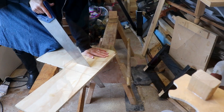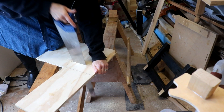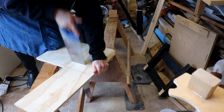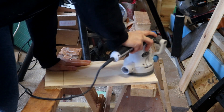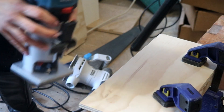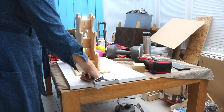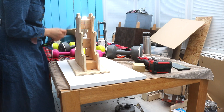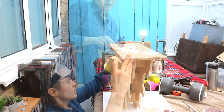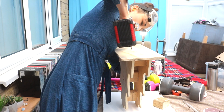I don't think the base was really necessary, but I can be clumsy and my dog can certainly be lively. So I hand sawed another offcut, giving it a nice lip, sanded it and rounded the edges off again. Finally, I lined the base up evenly, checking all around with a combination square, made some quick pencil references, then glued it and lined it up with those pencil lines, adding two screws per block from the bottom.